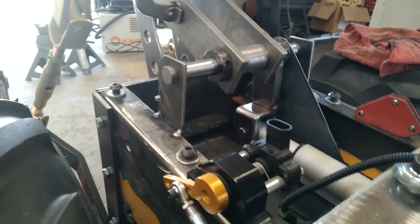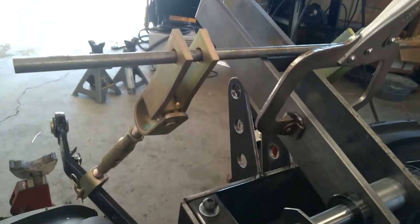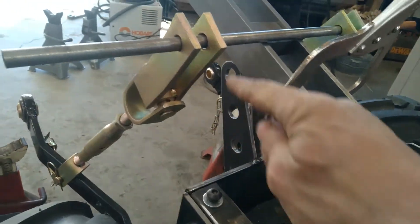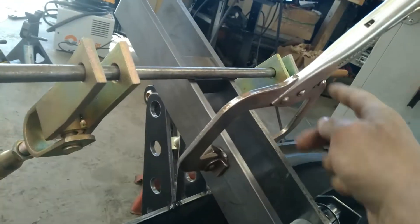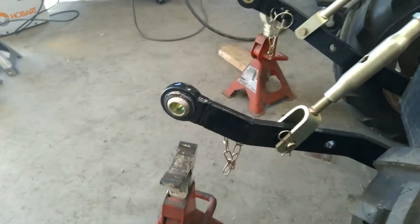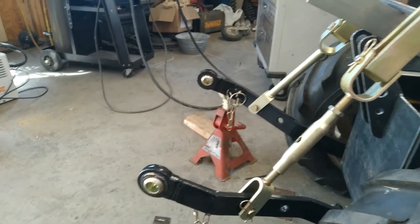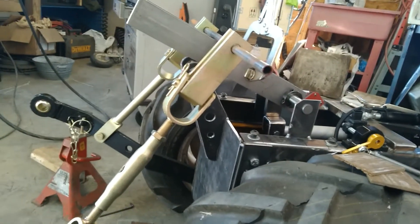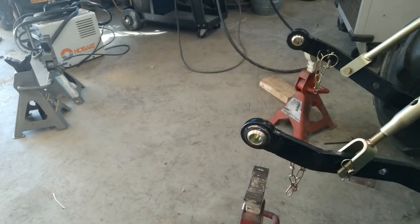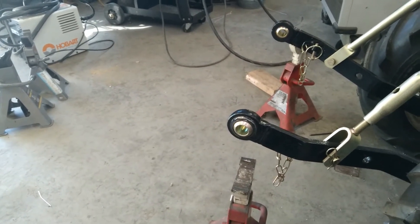This is a four-inch stroke actuator on a four-inch arm. That four-inch arm is going to go out to these lower links, which will end up being either 11 or 13 inches long. I'll put a bend in here — it'll bend over and come back straight and go into each lower link arm, which has another seven inches or so to the end. So if you take that four inches and put it out — 11 inches plus another four, that's 15 — you're looking at about a four-to-one ratio. So when the actuator moves four inches, the end of the hitch arms is going to move about 16 inches up and down. At four and a half millimeters per second, that works out to about 18 millimeters per second at the end — it's going to be a lot faster once it gets out there.